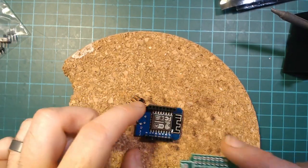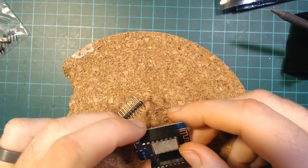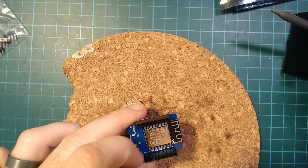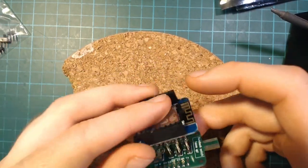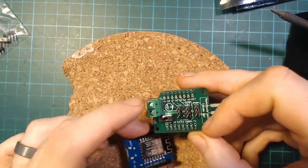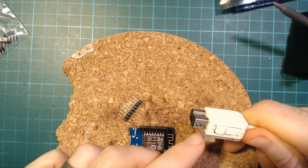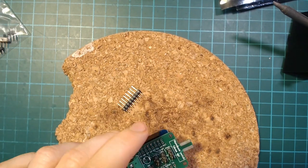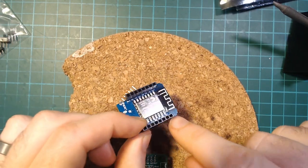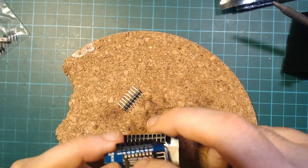As mentioned, the plan is to have the shield sit down into a D1 Mini. One thing to be careful about: if your D1 Mini has male header pins, it's possible to wire it the other way, but the shield is designed to go on top. The servo pins would be poking up, causing problems if slotted in from the bottom. Also, the Nunchuck has a large chunk at the bottom, so balance-wise it makes more sense on top. Make sure your D1 Mini has female headers on top, and same for the ESP32 version.